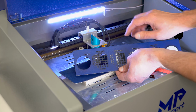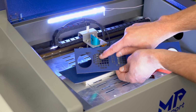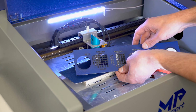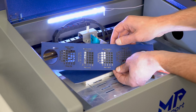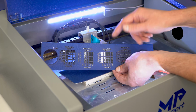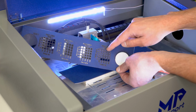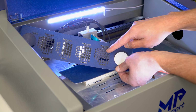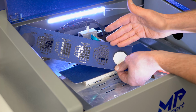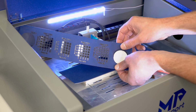In this first setting, that's exactly what I had. I had the laser perfectly in focus, and it was just too difficult to find a good setting. It's not until I did that defocus laser head that I could start getting some nice, clean, consistent results. And by the way, when I did my test cutout pattern, I left the laser defocused, and there's still plenty of energy to turn the laser up in power and get a nice, clean cut through.